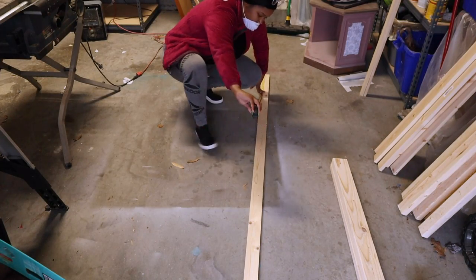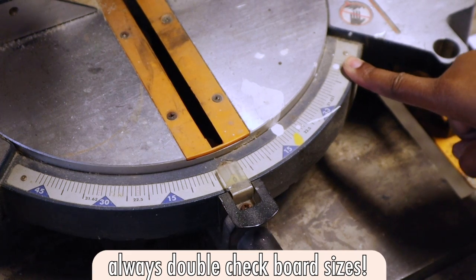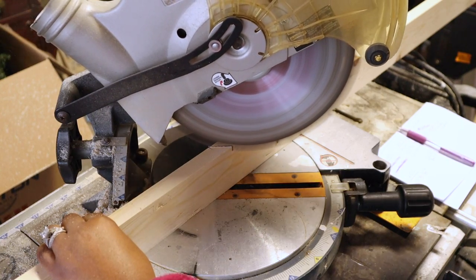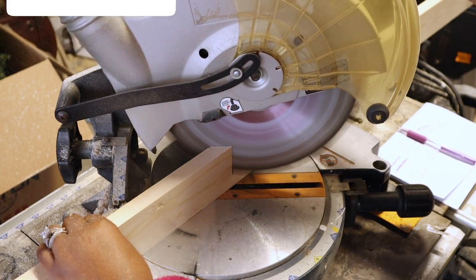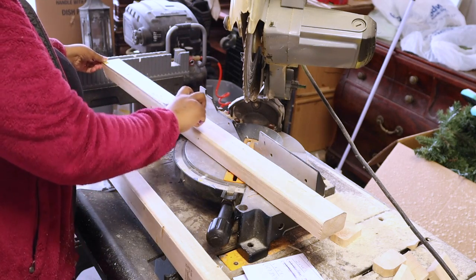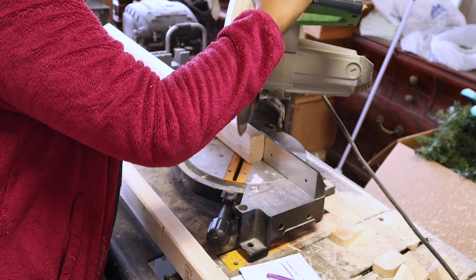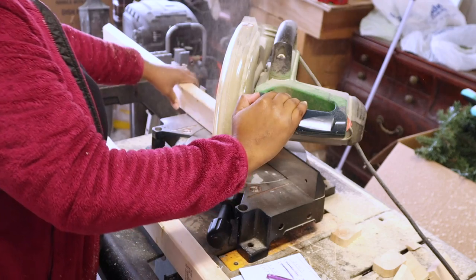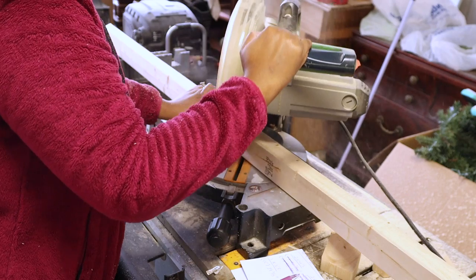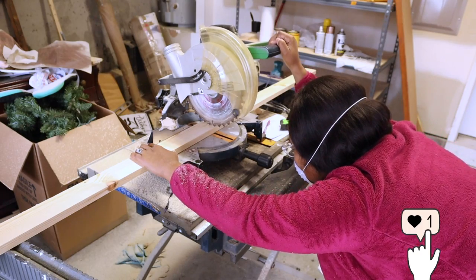For this next cut you should be cutting your two by threes — I accidentally cut my one by threes, but your two by threes are going to be cut at a 45-degree angle at one end, down to 47 and one-half inches, and you should have four separate pieces. Moving along, I'm now using the correct size — the two by threes — and cutting these down to 33 and one-fourth inches with opposing 45-degree angles at each end, giving you four separate pieces.